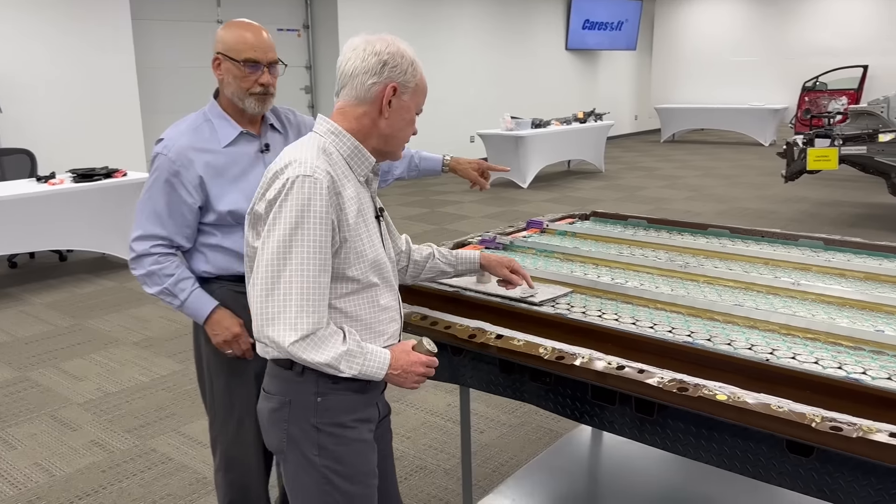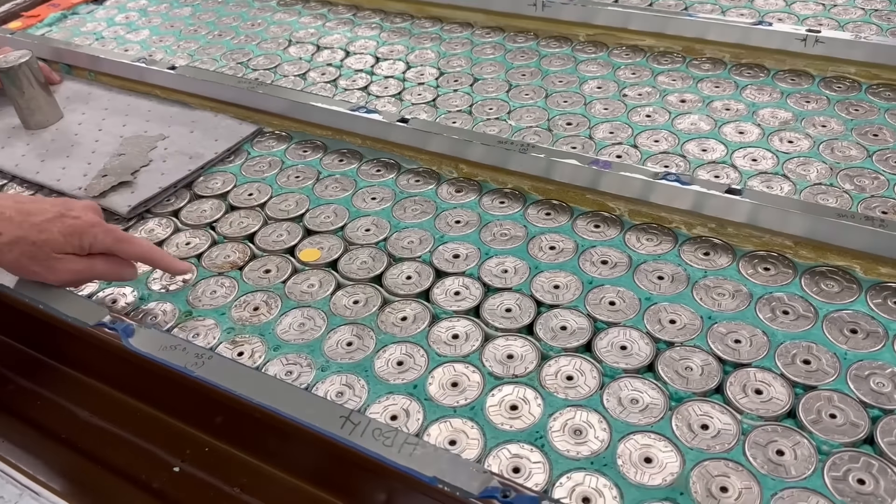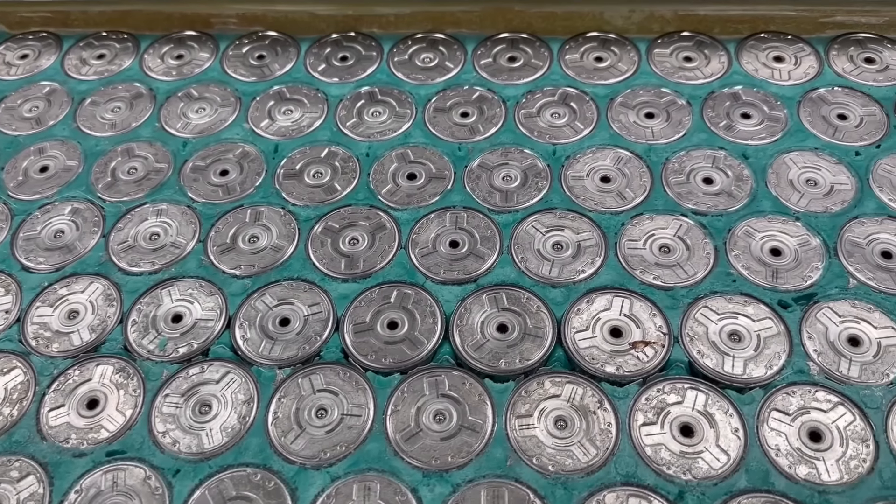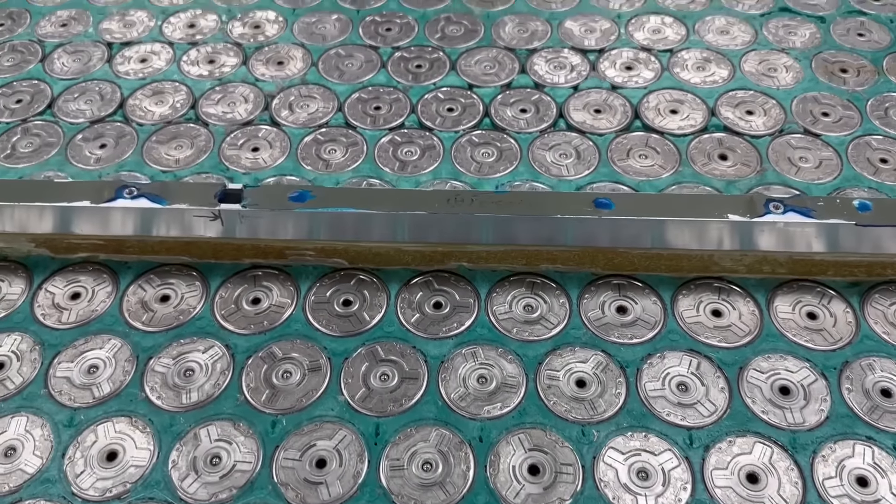You can also observe something interesting here when you get all this covering off. The fill that we talked about — you can notice that there are areas where the fill isn't complete. There's not foam in areas like this. So that's part of the process. When you think about the process to fill this whole thing with foam, let it grow and expand and completely seal it all off — there's still room to improve that. Do you think this is not deliberate, the foam just didn't get there? Well, there's foam down in there, but it wasn't enough injected or the temperature was different and it wasn't able to rise. This is like putting insulation into a house — they spray a little bit and it grows up and fills between the studs. So more process development needed.